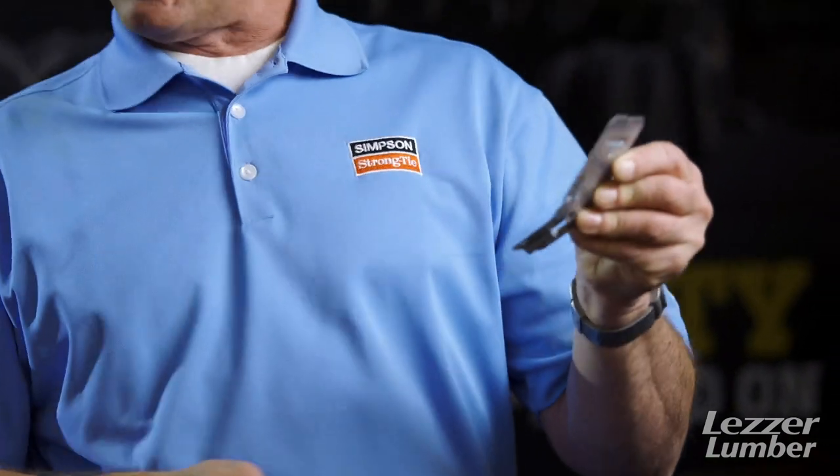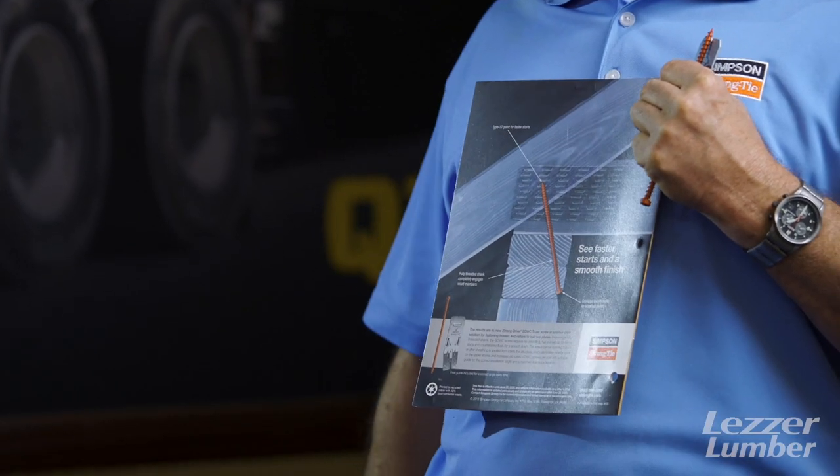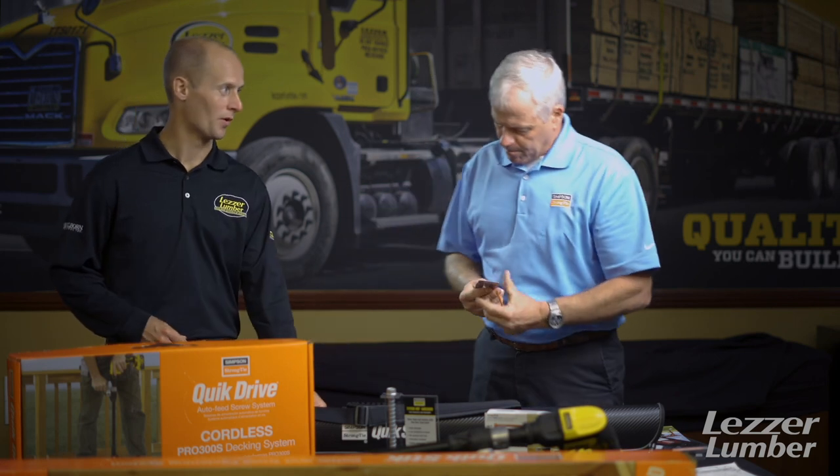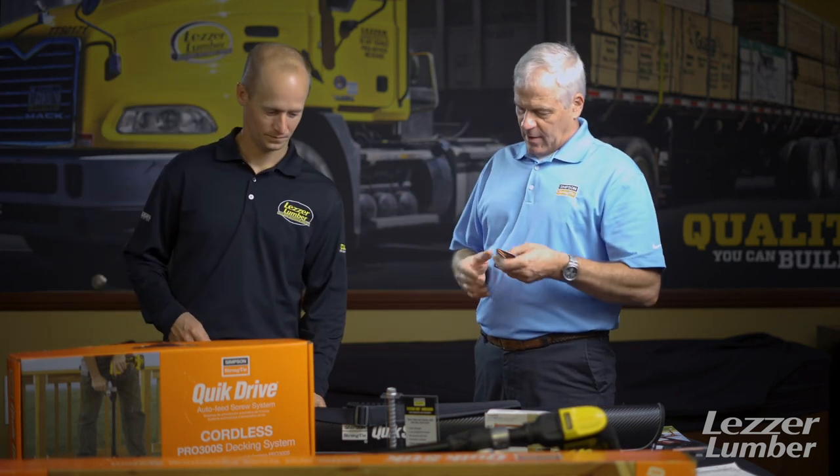This product's been out about four years with great reviews. The simplest part is this is just an installation guide — there's a notch on the guide that goes up to your double top plate. He starts with his impact driver, the screw goes in and passes right through the guide. What you're achieving is the connection going through the double top plate into the truss. It is important that you get the proper angle to get the load out of it. If this screw is off five or ten degrees, the loads vary greatly. This product beats all the competition because we have such heavy loads — we've done the homework and we know where it needs to be.